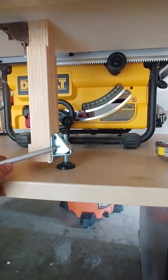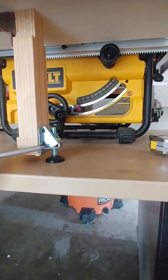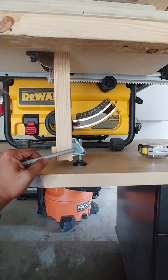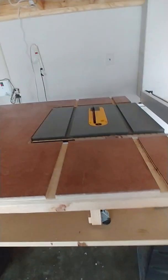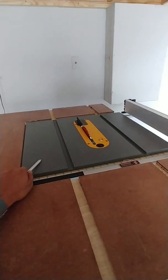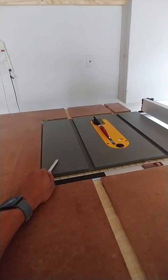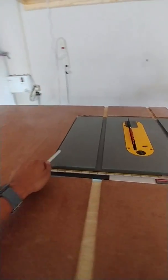There's also something called a lifting leveler — a heavy-duty lifting leveler. I got them from Rockler; that's the only place I found them. With these I can adjust the height on all four sides of the table to match the surface height of the table saw.